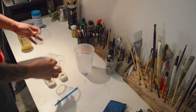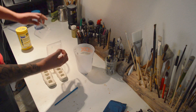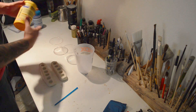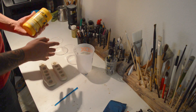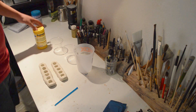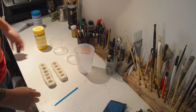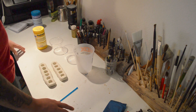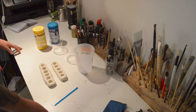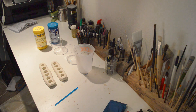I've got my two measuring cups — I'm going to put Part A in one and Part B in the other. I already got it measured out using a ruler, and with the Rebound 25 it is a one-to-one mixture. It says to use it in a well-ventilated area. I have the fan on and the window open so I think I should be okay. I have my respirator just in case. I also have a floor mat down because there's carpet and I don't want to ruin it.